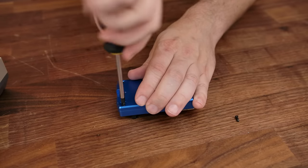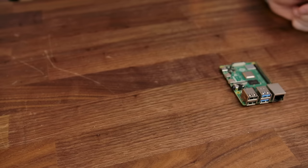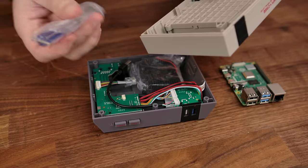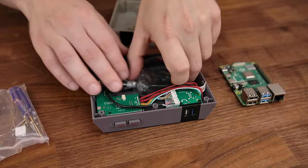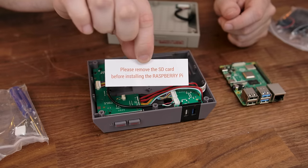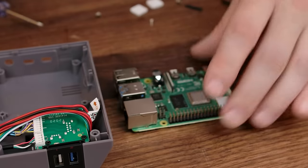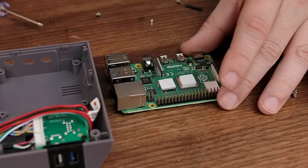Let's get this Raspberry Pi 4 out of the blue metal case and into the NES Pi 4. This thing just cracks open — it doesn't come screwed together from the factory, which is kind of nice. Inside we've got our screws, a couple of thermal pads, and a pretty decent little aluminum heatsink. Also a note: please remove the SD card before installing the Raspberry Pi — which is helpful because I'm not going to use one. We're going to start out by putting our thermal pads onto the Raspberry Pi.